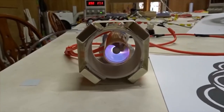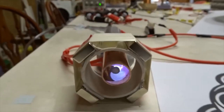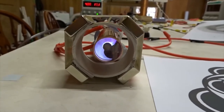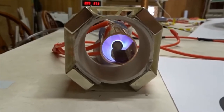I just solved the great secret of how to make arcs of plasma swirl in a plasma railgun. This is argon gas. You have to use a radial-magnetic field with four magnetic poles from neomagnets pointing in. Then it swirls very rapidly. Ring magnets work a little bit, but not as well.